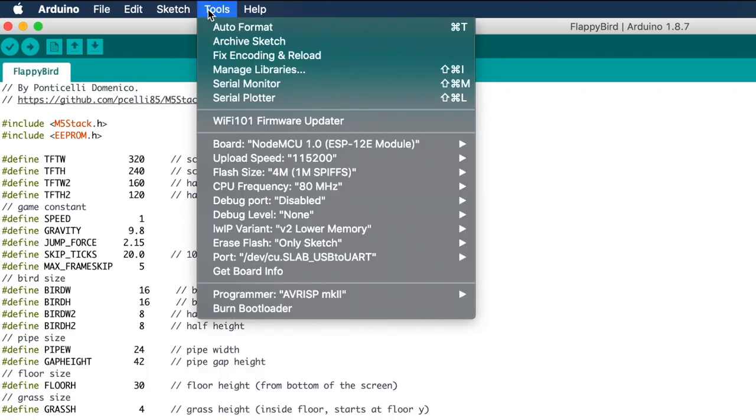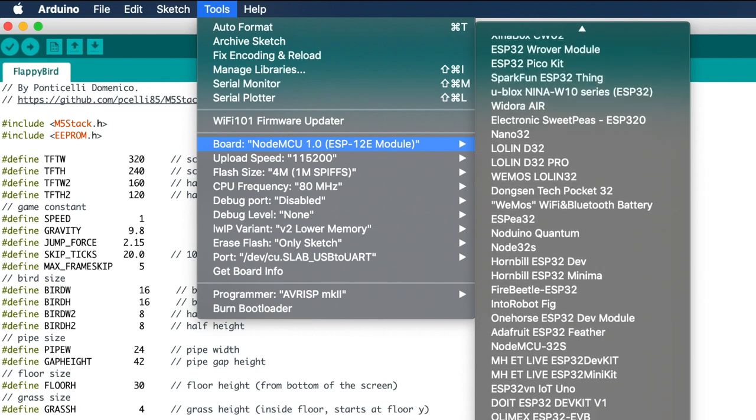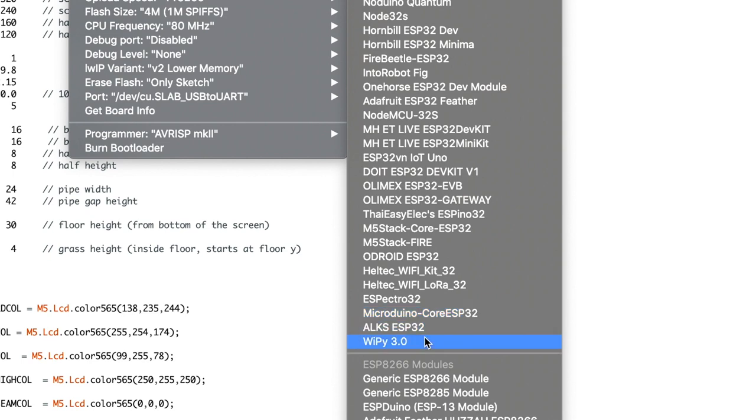Let's just select the right board. So we'll go into the tools, into the boards, and in the boards, we should be able to see M5Stack. Okay, let's just focus here. So here is the M5Stack Fire, which is already available inside that ESP32 package. So select that first. And on the port, it already shows this